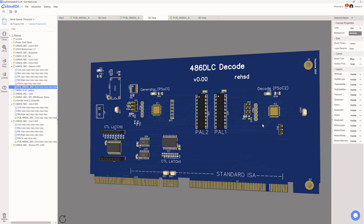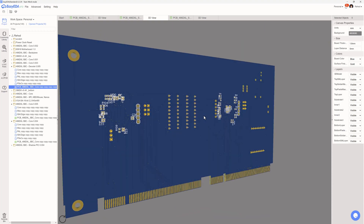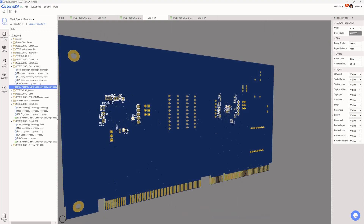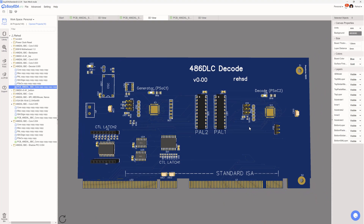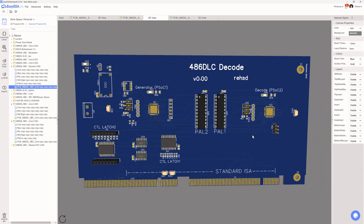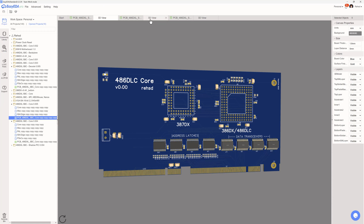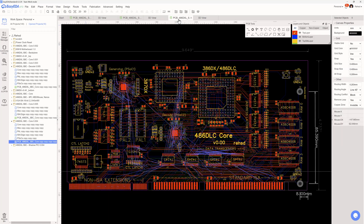On the second PSOC I just had two lines left to route. I just need to rearrange that a little bit so the caps are underneath in the same way, and I think I'll be fine. This decode card would plug into the chassis along with the processor card, and between those two I'd have much of what's on the core card. Clock distribution would go on the backplane.